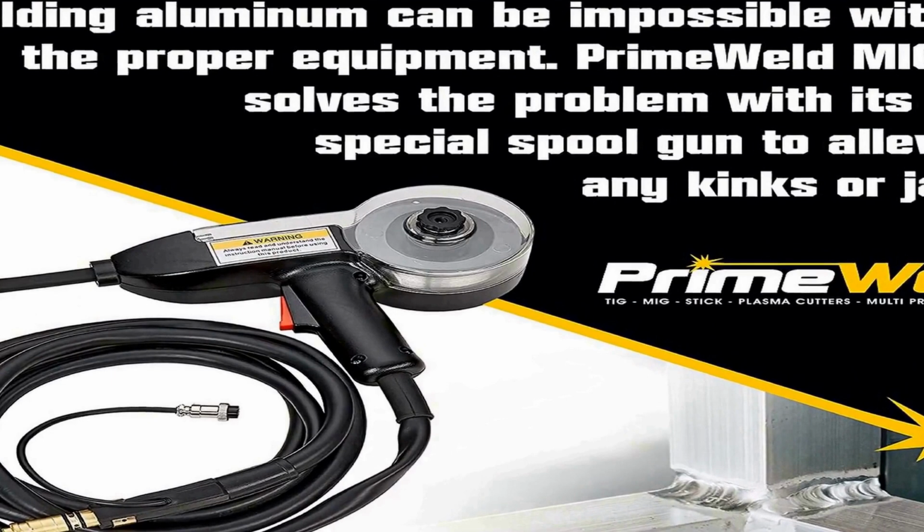Aluminum welding. Welding aluminum can be impossible without the proper equipment. Prime Weld's MIG 180 solves the problem with its own special spool gun to alleviate any kinks or jams. Multiple features. This welder machine has dual 120/240 volt input and can be used as a DC stick welder, MMA, flux core welder, FCAW, and of course a MIG welder, GMAW.